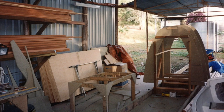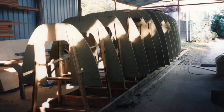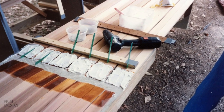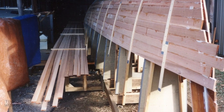The construction was strip plank western red cedar — basically a wood-cored fiberglass boat. My reasons for building it this way were that it's a simple system for a one-off boat. You don't need to build a mould before you can make it. It produces a very fair hull. It's strong. It's light. The cedar strips were 14mm thick and for the majority of the boat 90mm wide. What I bought machined were not long enough to make up the length of the hull, so they have to be scarfed together to give you the full length. I set up a jig with my brother's radial saw to saw them all and give them a feather edge for scarfing, then set up a jig table to scarf them all together. Once they were dried, I could start screwing them onto the temporary frames, edge gluing them as I went to start to form the shell of the hull. The edge glue is a mixture of epoxy resin and cabosil, which thickens it to a peanut butter consistency.